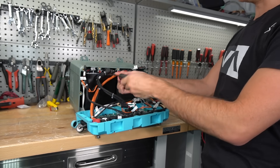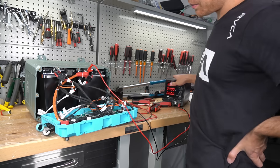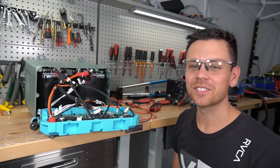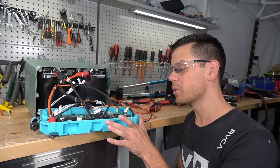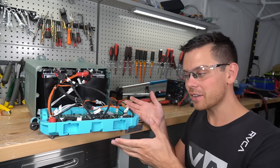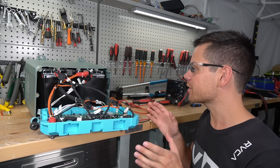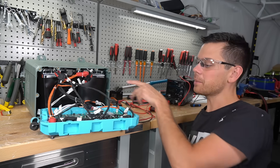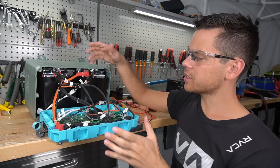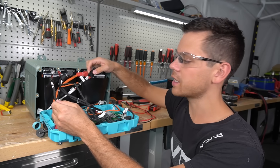That means we can't test it — this is awful. I connected a power supply and it's not charging at all, which is pretty obvious why. This is not the first time. But I'm going to get another one because this might be my new favorite marine-grade battery. This kind of quality for the price is unheard of. The BMS is fried because I switched the two balance cables.